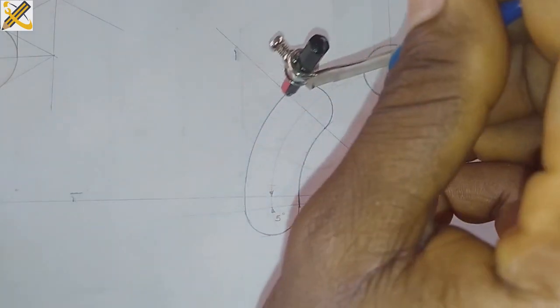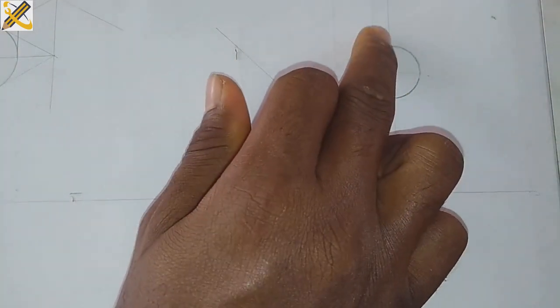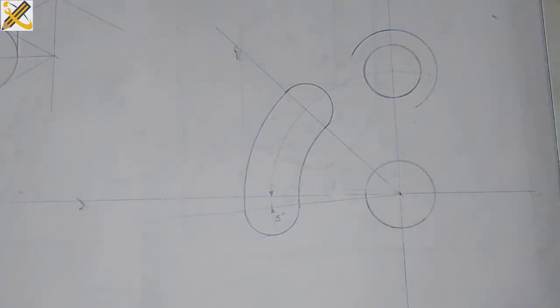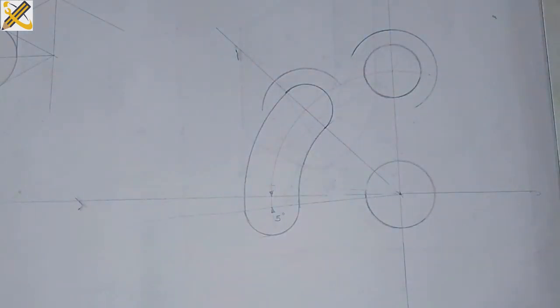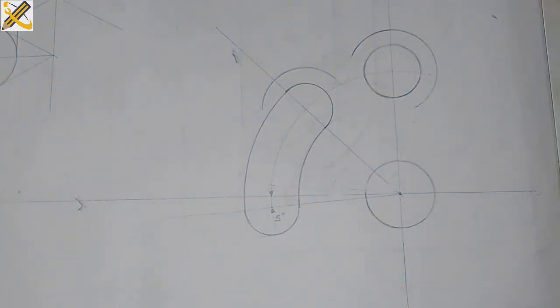Towards the top I have the bigger circle of radius 20, so I'm going to pick that now — radius 20 — and draw it out. Center line, radius 20. Then towards this area I also have radius 20 here, and I draw it out. The arc joining this circle and this circle together is an arc of radius 20, and looking at it, it is an external arc.